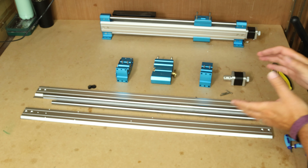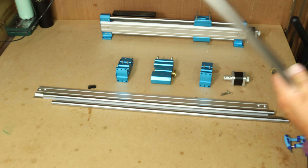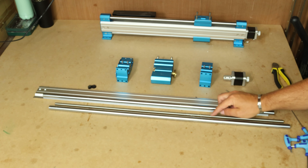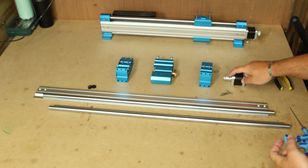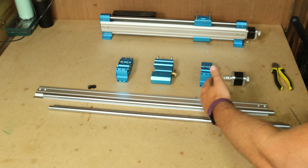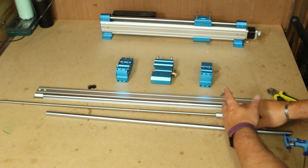Now we'll bring the new extension kit in. When it comes to the parts for the y-axis, the two pairs are very similar but there are some slight differences. One dust guard has a load of holes in it — that dust guard goes on the y-axis with the electrical box connected. One of the rods also has cables running through it, again for the y-axis with the electrical box. We need the two hollow rods, the new lead screw, and the two plain dust plates. The next step is essentially the reverse of what we just did.